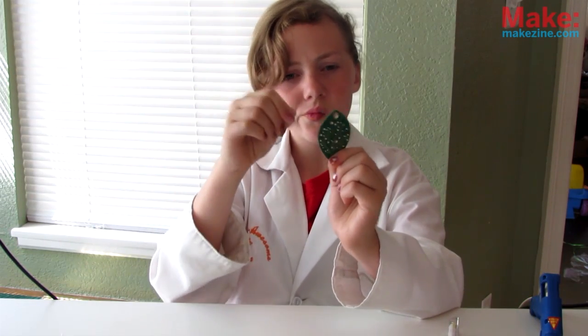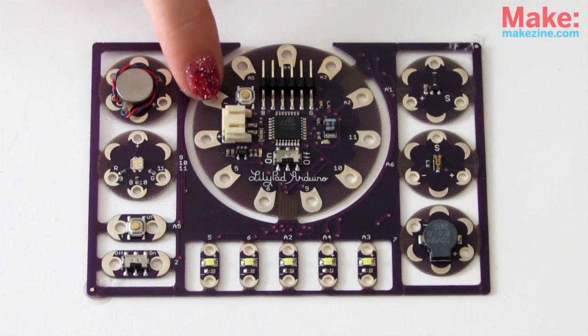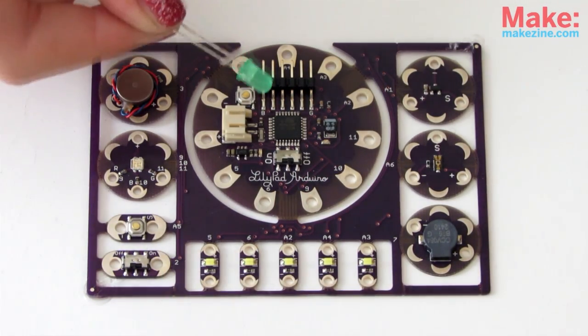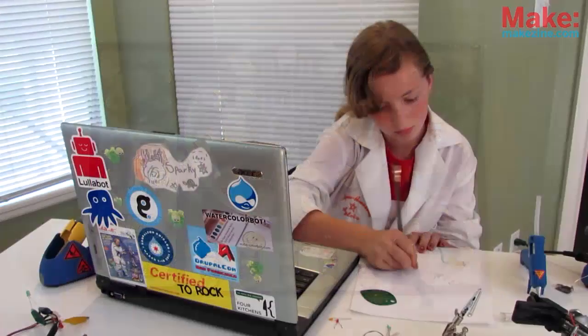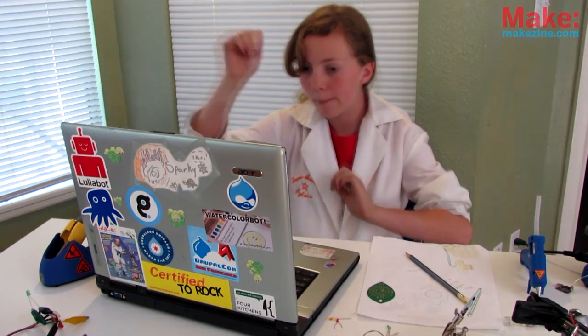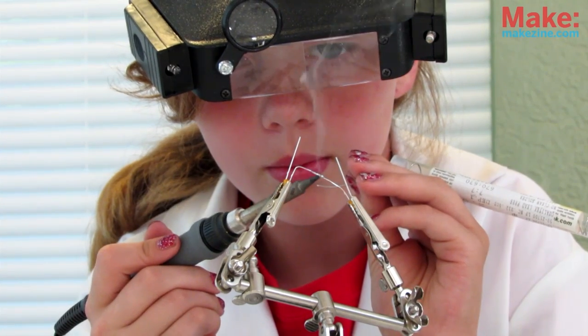First, let's prep our pendant. Plan out what LEDs you want on it and how you're going to wire them. We'll be tying into pin 11 and ground, so when one LED lights, they'll all light straight from the logic voltage provided. Use an online LED circuit calculator to make sure you have the right resistance for the voltage and your LED types.